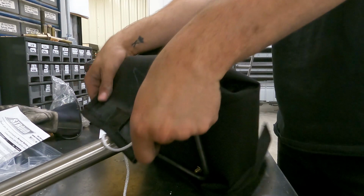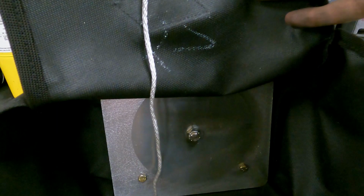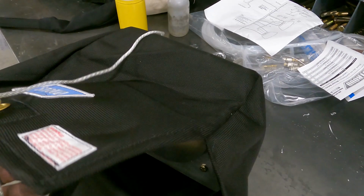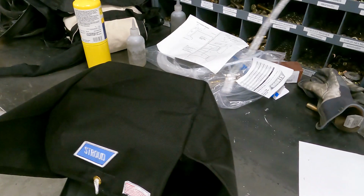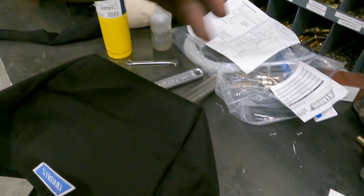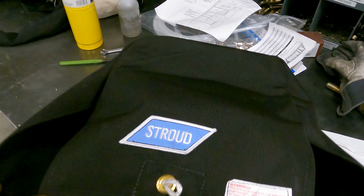Basically the main concept of this, some people haven't seen this, it's got that plate in there, and then when you get back to the pits, pack the chute, you arm the air system that goes to this cylinder, which puts pressure on that bag over there. And then when you pull the chute cord, or you lose your pull string, that's important, you pull the pin, as you call it, the chute cable. When you pull the chute cable, the pressurized cylinder forces the bag out. So when you're packing it, you don't have to fight a spring. You're just basically, obviously a little further out, but then you just push it back in and then you throw the bag in. So it makes it a little simpler, especially with just one person.